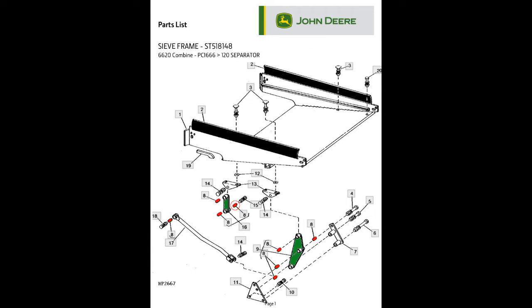This is the parts diagram for the sieve frame. The rear arm uses four bushings and the forward arm uses two. In some later models there is an extra bushing in the forward arm. Notice also a bushing in the Pittman arm. Again the left and right side are the same, so for the sieve frame you will need either fourteen or sixteen bushings. The total for both frames is twenty four or twenty six.